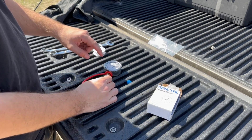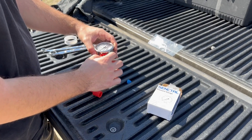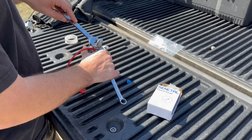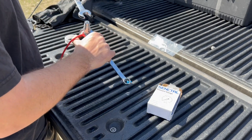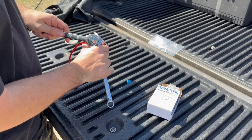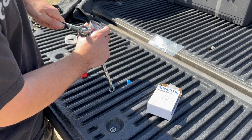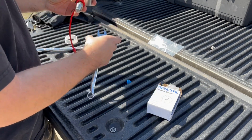Now, it does specify that when doing this you don't want to tighten with the gauge itself — you want to put your wrench on the brass fitting in the bottom, that way you're not damaging the gauge or anything. So we put one wrench on there, one on there, and then just start tightening it down. These are quarter-inch NPT threads with a quarter-inch ag-style hydraulic fitting, so that should seal pretty well on the threads. I'm not going to go ridiculously tight — that should do it.